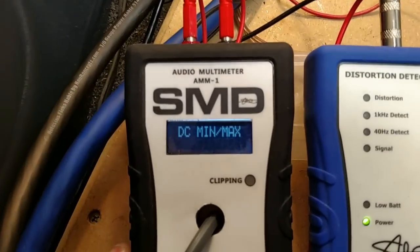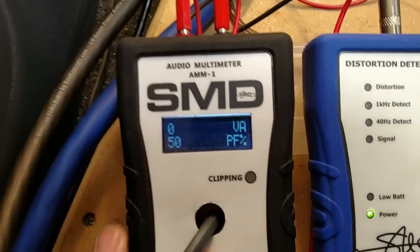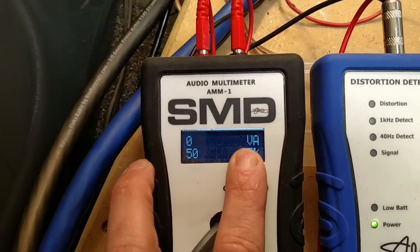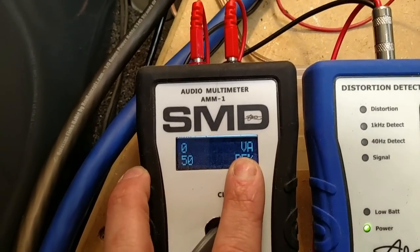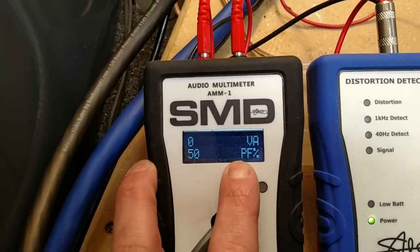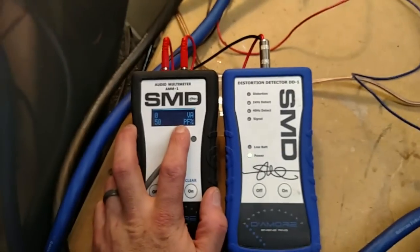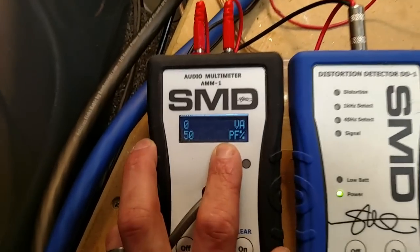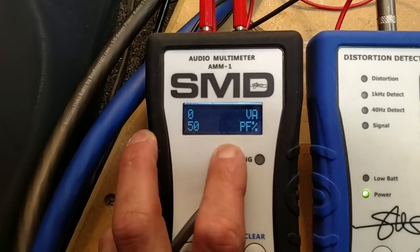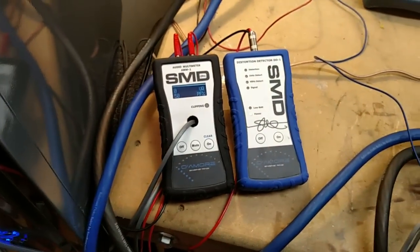There's a setting in here that you can actually go to and see the power factor. So this is your volt-amps — this is what you would get if you would clamp this amplifier. And this is your power factor, the percentage of that that's actual usable power. So that's what a lot of people just don't get — you cannot apply Ohm's law directly to AC; you have to have other factors. So hopefully this clears up some stuff and shows that my tests are accurate. I'll have more tests coming for you, so stay tuned. See you soon.